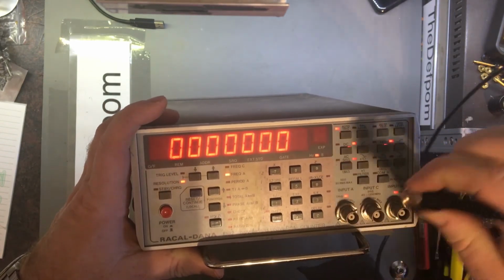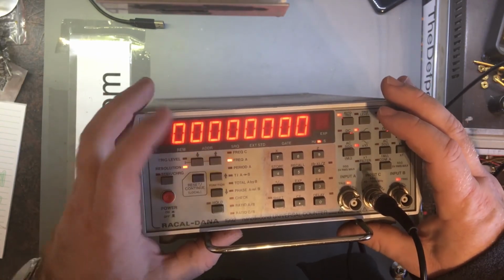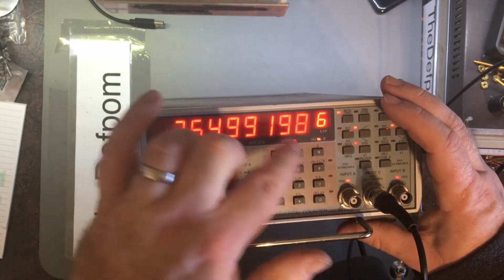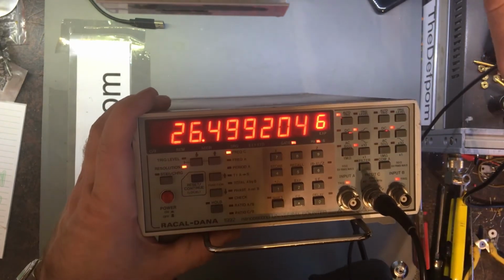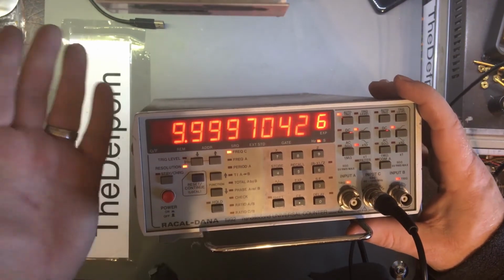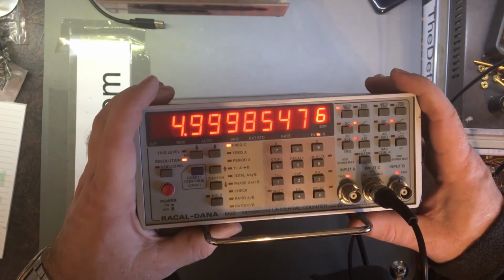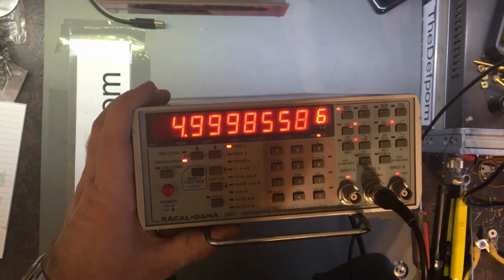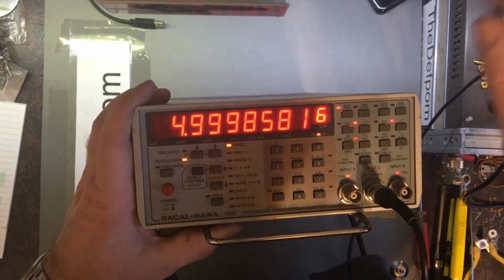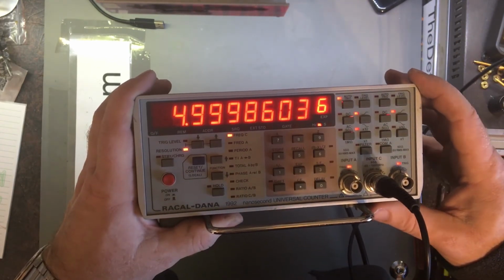But then that said, input C will work anyway. So it's stabilising better. It's getting closer now. Let's see what frequency this can go down to. Carrier frequency go 10 megahertz. Can it do it? Yeah. 5 megahertz. Yeah. No, I don't know. It's high level 0.1 volts. Okay, 0.05 volts, so 50 millivolts. It's still there. So that seems okay.